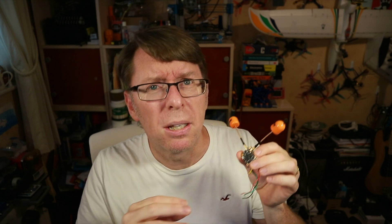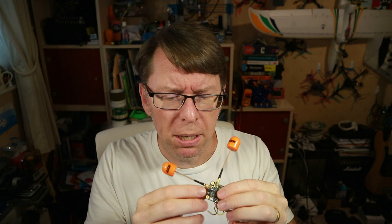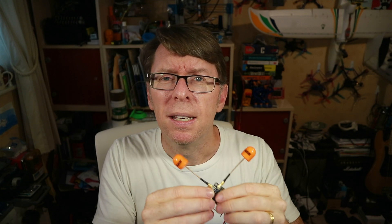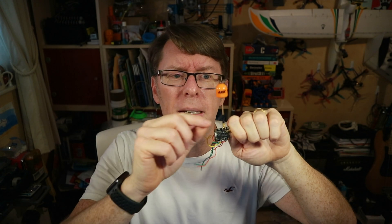I'll tell you why this is weird. It's quite a common thing when we talk about having the wrong polarity or having an antenna being blocked by a battery. A common thing for someone to say is 'why don't you just have another antenna on it — antenna diversity in your receiver?' The answer is generally we're trying to avoid what's called multi-pathing. Multi-pathing is when your signal goes somewhere, bounces off a hard object, comes back and hits your goggles. At the same time a different signal is coming directly to you, so you've got two slightly different images simultaneously — that causes weirdness and noise, although things like the Rapid Fire do their best to construct a full frame. You try to avoid multi-pathing by staying away from particularly difficult settings, like flying by concrete buildings where things bounce around. If you're over fields you won't see it.